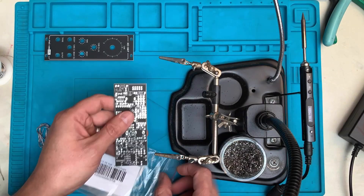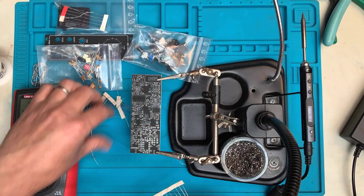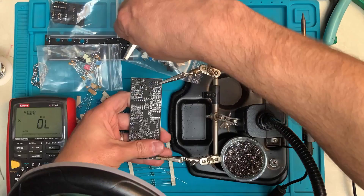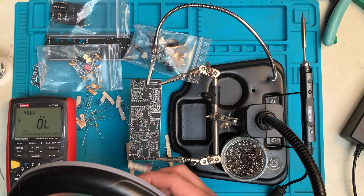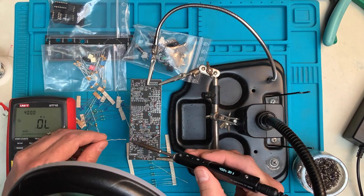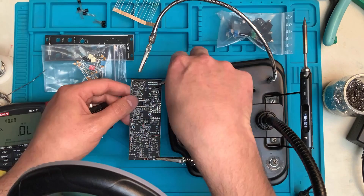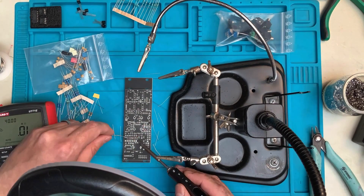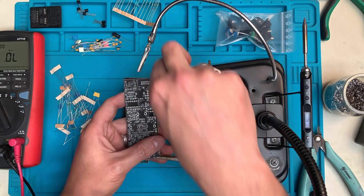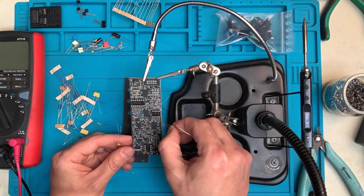Let's start by organizing all the parts on the bench and then we'll start with low-profile components first. In this case the diodes — plug them in, mind the polarity of course, solder them on. I can do this from above. Then plug in the IC sockets and solder those on. I use the panel to keep the ICs in place as I turn the board around to solder.